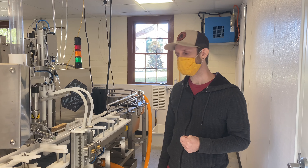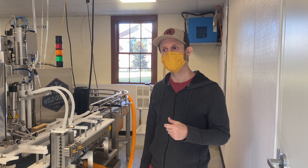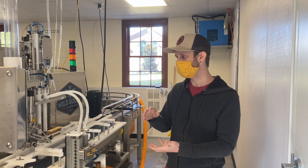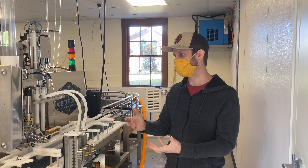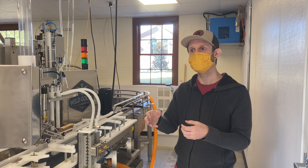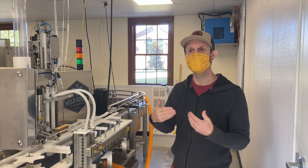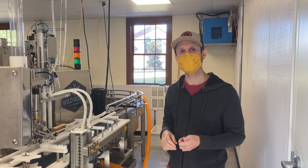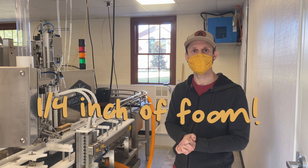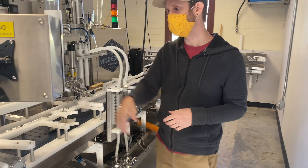What is a nitro doser? It takes liquid nitrogen and drops it on top of the cold brew to get rid of that oxygen headspace. A cool thing happens in the can — since it's in that high-pressure environment, it nitros that small amount of liquid. So whenever you pour it into your glass, it will actually give it a quarter inch of head on top, much like a craft beer. It drops the liquid nitrogen on top, the can gets a lid, and comes into our seamer.